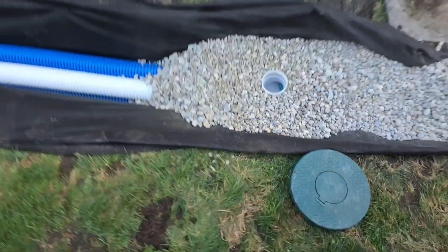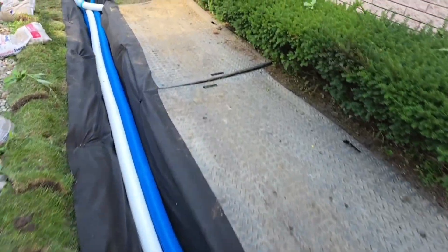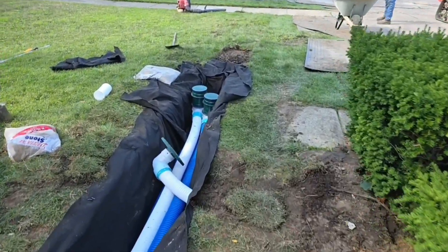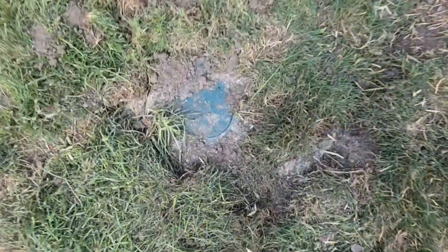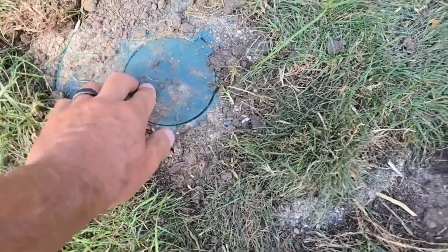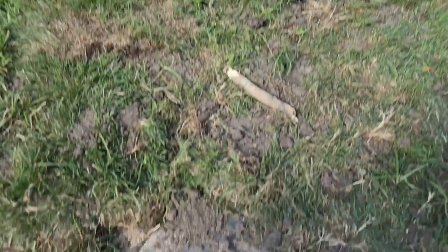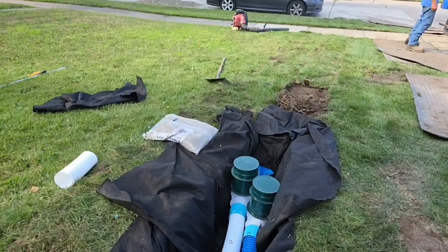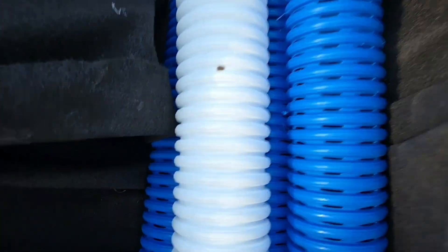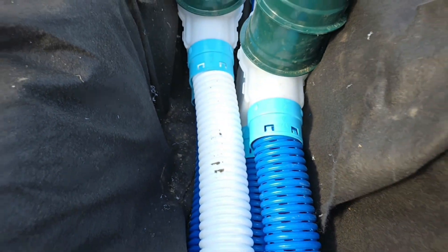Right here is that pop-up emitter, right at the top of the French drain. We're not going to get any garbage in the French drain because there's going to be grass around the pop-up. If any tree buds or tree seeds come out of the pop-up emitter, they'll be in the grass — you don't have to worry. There's going to be no contamination in the French drain system. Right here you can see two perforated pipes on the bottom, one perforated pipe on top with the solid for the yard drain.